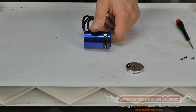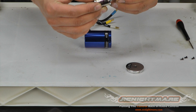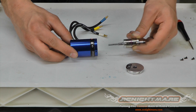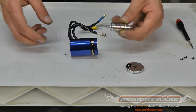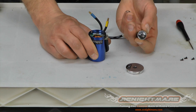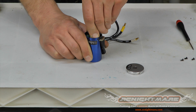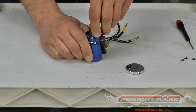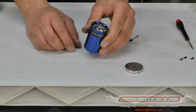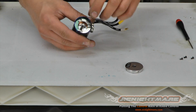To put it back together, grab your rotor and put the spacer and shims back on. Now we have to be extremely careful — if you just haphazardly push this in it's going to snap in real tight, and if it's not lined up you might damage your motor or pinch your finger. What I like to do is stand the rotor on end, get the front of the shaft right where you want it — it's going to want to pull in real fast so pinch it hard — get it lined up with the bearing, then slowly raise the can and the rotor will pull itself right in. The shims are still on.